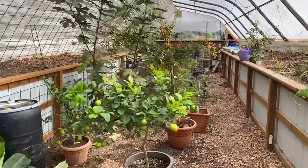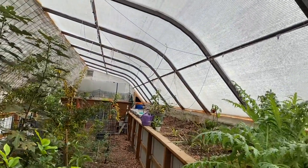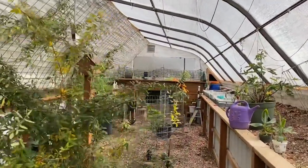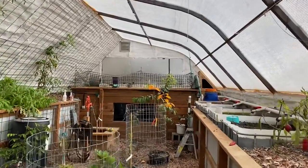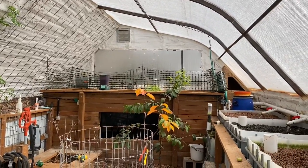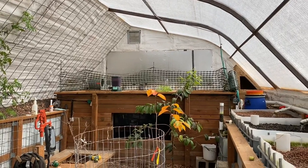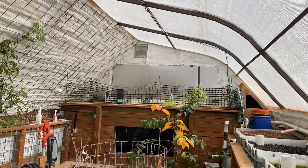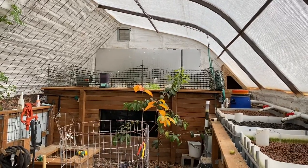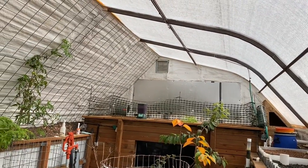Sensors are telling me it's about 58-59 degrees in here right now. We have no heating and no cooling going on - the only heating is where we get a little bit of sunlight, which does warm this greenhouse up. On the far end here we have insulated the vents - you can see insulation on the big vents, we've left the top one open, but we've insulated the big three vents and taped some plastic on the outside to help seal any cracks so there's no cold air coming through. The upper vent is used for cooling when that fan comes on in the mid-80s, pressurizing the main growing area and pushing air through the vent pipes. When the fan goes off, the vent closes, and it works really well.